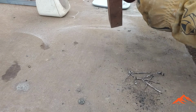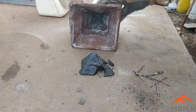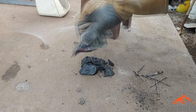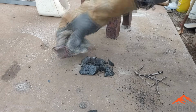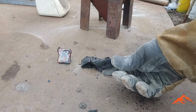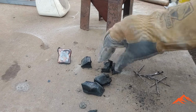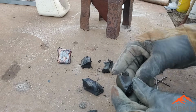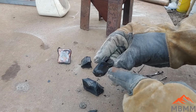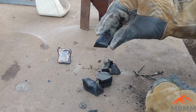All right, here's our first run with 10 grams of sulfur. There you go. There's our bead of metal like we wanted. And it doesn't look like there's any sulfides in there. So our slag absorbed all our sulfides. They'd be right here if there was a little matte layer, which there is not. So that worked pretty well.